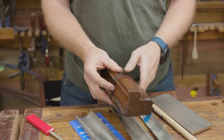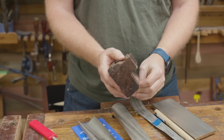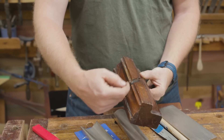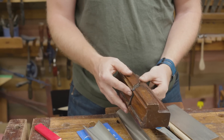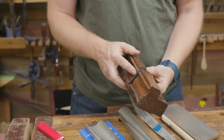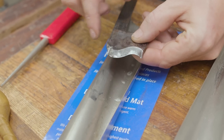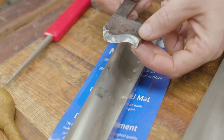Now we've spent time adjusting the profile. You can go back and forth — check if it's sticking up, see where you need to take off more, check it again. If you have a hard scribing knife, you can scribe the inside of the curvature so you know where to grind to. But I usually find it faster to just set it in, pick it up, check it, pull it out, and do it again. It goes fairly quickly. I'm going to spend a little bit more time regrinding and sharpening, then we'll take this thing for a test ride.